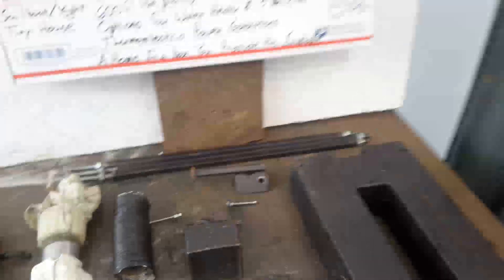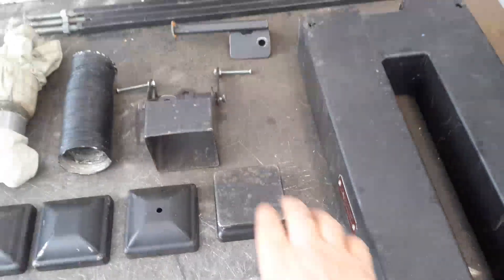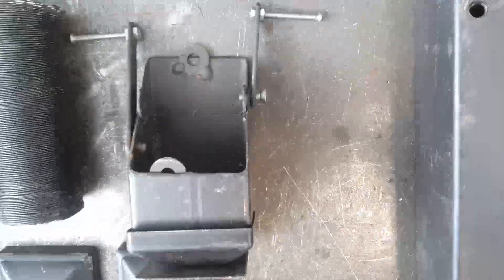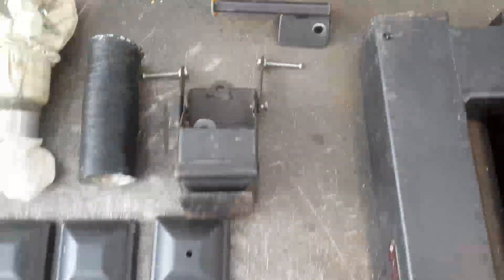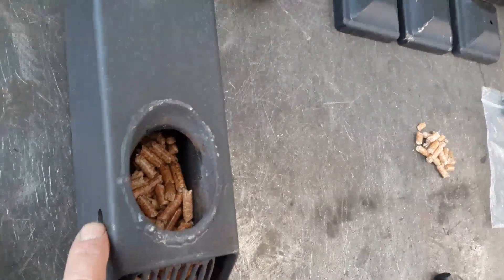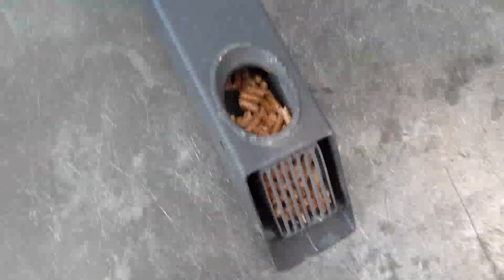We can go over the parts here. In the back we've got the legs. Then we have the ash drop and the cap for the bottom of the ash drop. The ash drop holds a bag and a half to two bags of ash, so basically every time you add a bag to the stove you dump the ash and brush the combustor. These lock the ash drop up into place through the holes on each side.